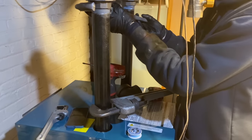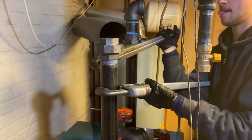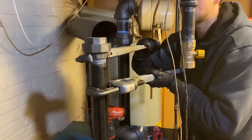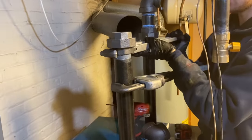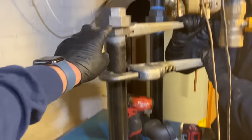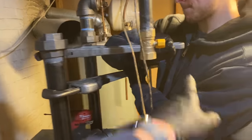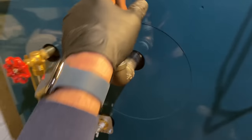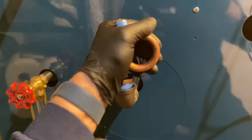All right, tighten — see? With two-inch pipe you should be using a 24-inch wrench. Keep your hand as close to the end as possible so you can maximize leverage. Almost done with the pigtail — I put the pressuretrol on there nice. Got my electrical box mounted.